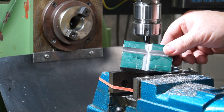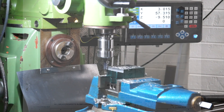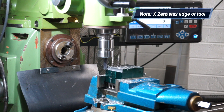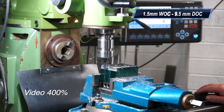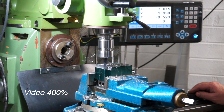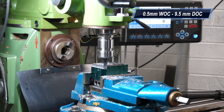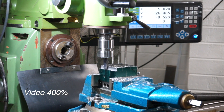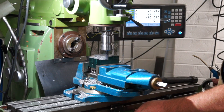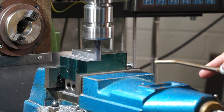Now we need to do the webs on all three jaws. I've clamped these together in the Y-axis — I made sure they were flush, each one of them. These are just my roughing passes here, roughing out the web, starting with the left hand side. You'll notice I'm going to a 9.5mm depth of cut and my step over is half a mil on the climb. All my roughing's been done — these are my final cuts to clean up the floor and wall.